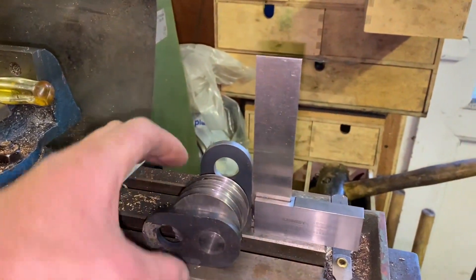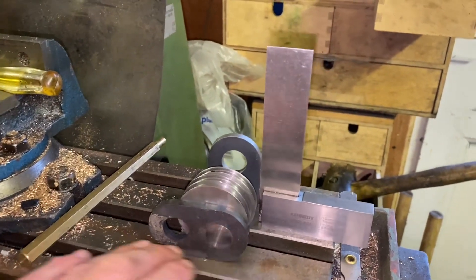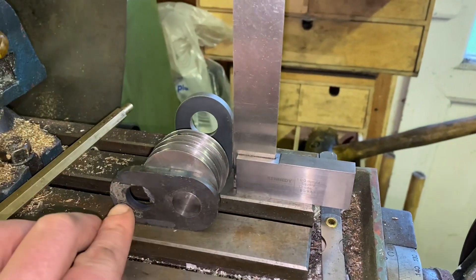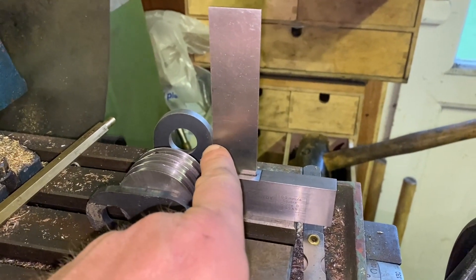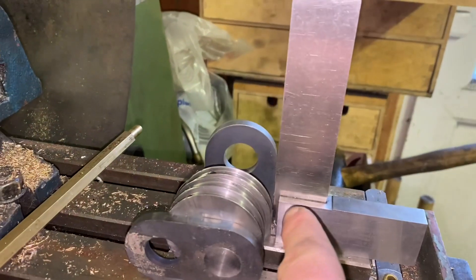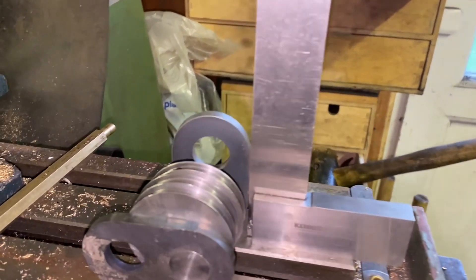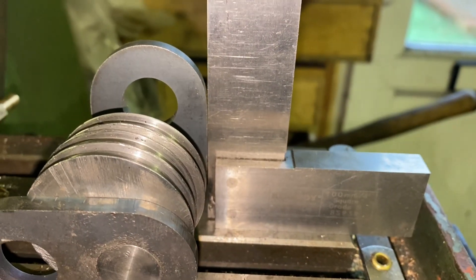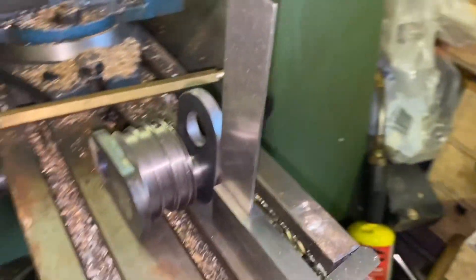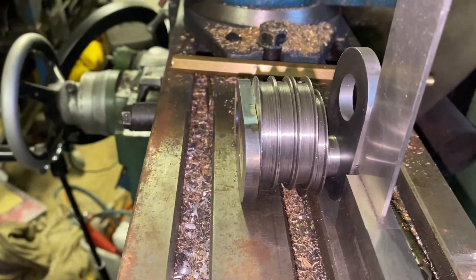This is my method for getting the crank set square. I've laid it on the table of the mill - this crank is at this angle, and the other crank is just started to be pushed onto the stub. I set it roughly by eye here, then I can adjust with a big spanner until it's square, and then I can finish pushing it onto the axle, by which time it won't be able to be moved.